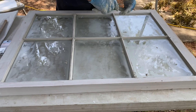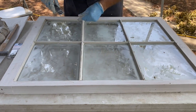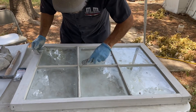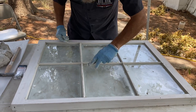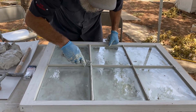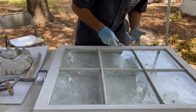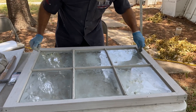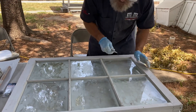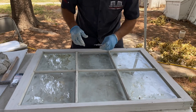This step is only for the outside of the window - yes, that's true. Because the wood part of the window sash, the molding, the decorative molding, that's what serves its purpose on the inside. And we already sealed it with our bedding. So it's got a nice seal in there. It will probably need to be adjusted a little bit, but you'll see in a minute when I go to dust everything with the magic dust that I can adjust a little bit as I go.